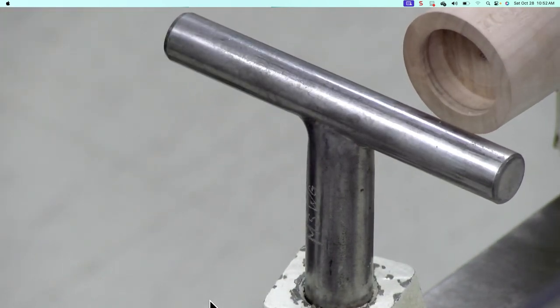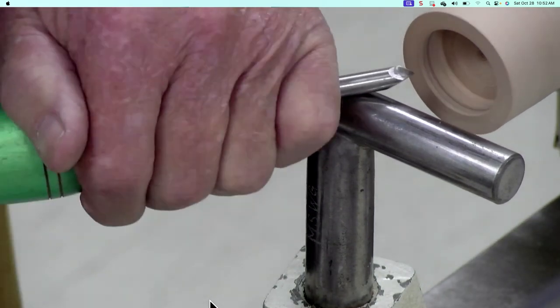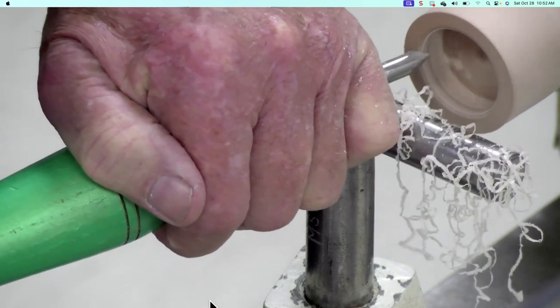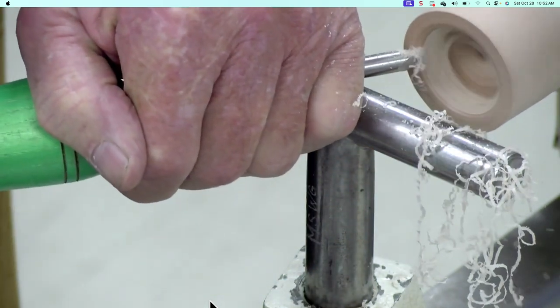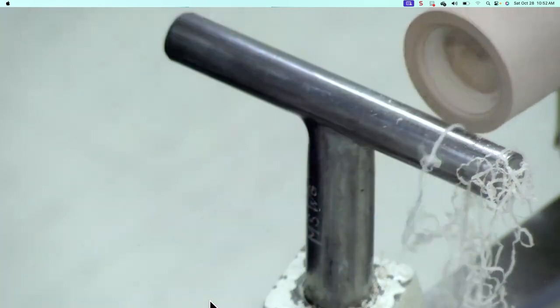But to me, the secret is to just barely round it over, and when you go in with a thread chaser, which I will hit in a second, to just barely touch that wood. Scraping, do they call it, scraping the wood. Anyways, let's go ahead. I'm just rounding that corner off. I don't know, maybe an eighth of an inch round? See the nice shavings you're getting off of that?